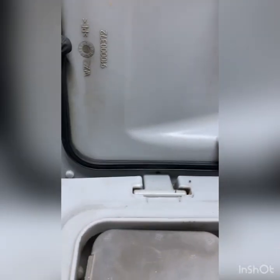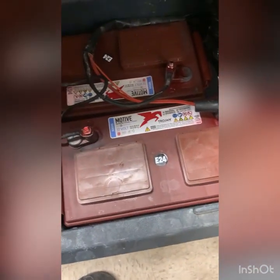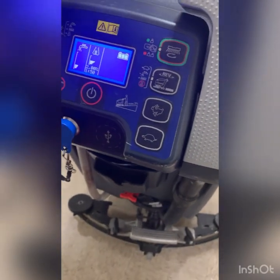I'm going to look at a few things that have to do with water lift, and particularly the gasket that goes along here, which is in decent shape. I just recently replaced the batteries and that's when they said things started happening. We gave them the gift of batteries, which they paid for — you can see the date code from this year, so I was here probably a couple months ago. There was a lot of acid to clean up, but that wouldn't affect the water lift. So there are several factors; let's take a listen to the vac motor.